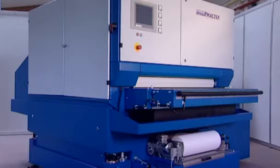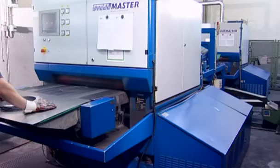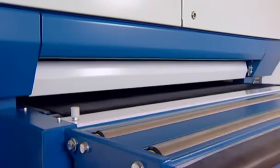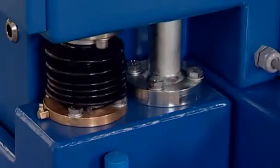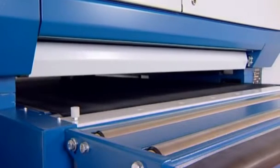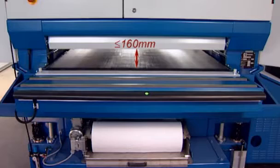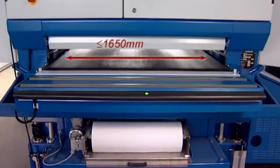Let's start with a constant working height of 900 to 950 millimeters. Depending on the machine version, the configuration of a production line composed of several interlinked machines is possible. Accommodating units are moved at a positioning accuracy of one-tenth of a millimeter. As an option, we also offer a one-one-hundredth millimeter precision adjustment. These machines easily handle workpieces measuring up to 160 millimeters in thickness and 1650 millimeters in width.